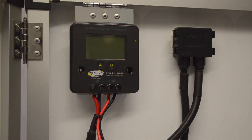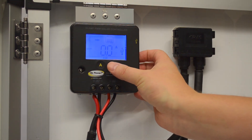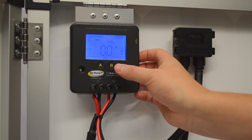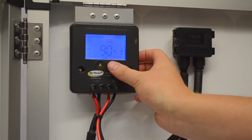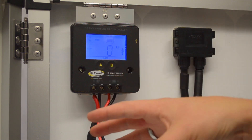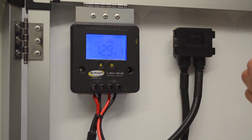We're going to connect the panel to the battery now. When we do that, we'll see the controller do a full startup — it does a self-diagnostic first, then starts off showing battery voltage, which is what voltage we see at the controller coming from the battery. If you hit the B button, you can cycle through: it shows current — how many amps are coming from the solar panel to the battery. We're indoors so it's at zero right now. It also shows the percentage of battery remaining, the amp hours accumulated from the solar panel to the batteries over a given time, and then returns back to battery voltage.